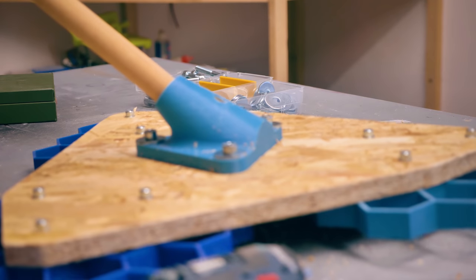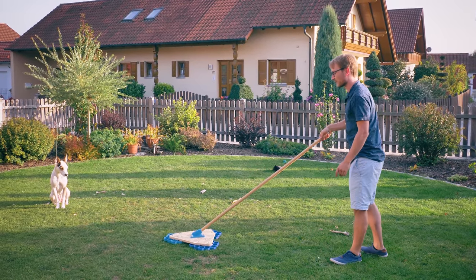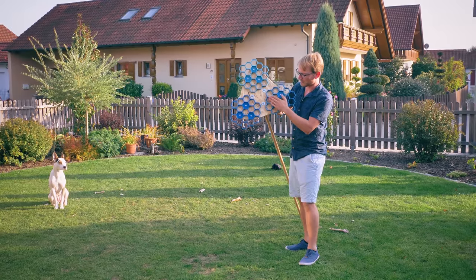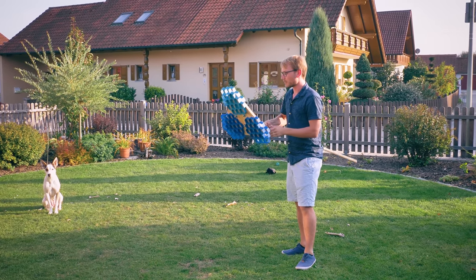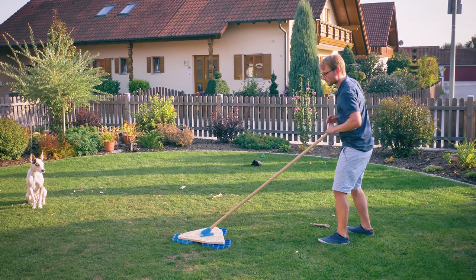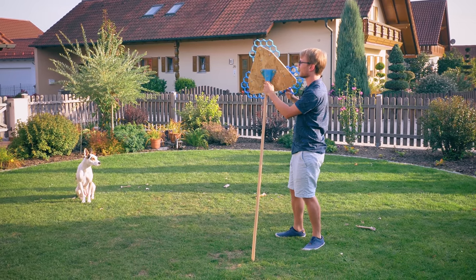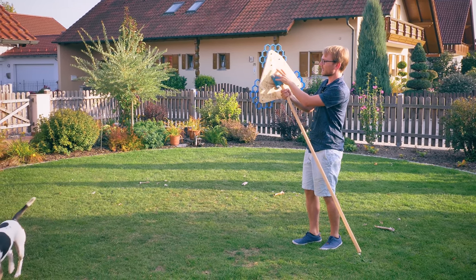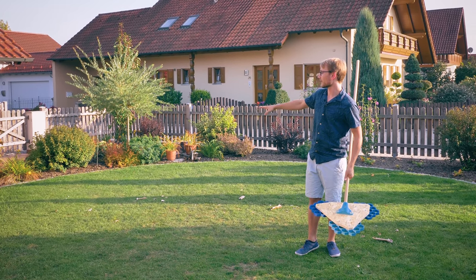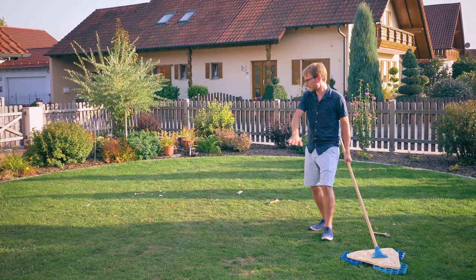Seems to be holding! So that's the finished tool — it's gotten pretty heavy overall. I like the way it feels in the hand and it is very easy to use, but I've noticed it's pretty hard to push. That's a combination of two factors: these are very sharp on the bottom with no gliding surface, and I think I need to lower the handle angle a bit so I'm pushing it over rather than into the ground. Also the handle is rocking around in the holder and doesn't feel very safe, so I'll end up reprinting the handle mount piece overnight. What I can still do today is give this lawn a really short mow so the sand and compost can get underneath the grass and give it a nice, even surface.